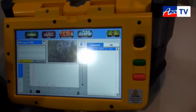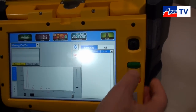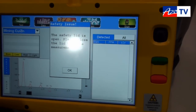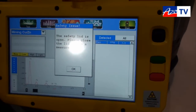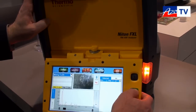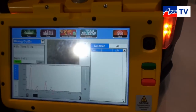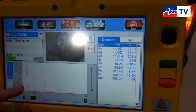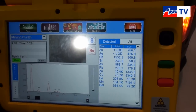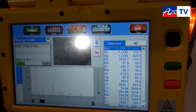To initiate a reading, it's as simple as hitting the soft start key over here or the green button. We'll see that this is truly a closed beam system with complete safety interlock, so we'll have to close the cover before we can initiate a measurement. If I close the cover and hit the start button, we'll see that the orange X-ray lights begin to flash and it begins to acquire data. We're capturing and displaying both the X-ray spectrum as well as the chemical composition in ppm or percent by weight, along with the two-sigma confidence interval along the right-hand side of the screen.